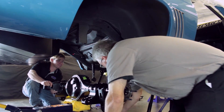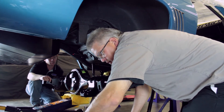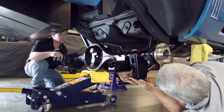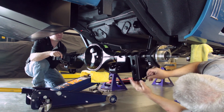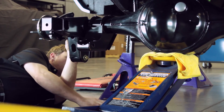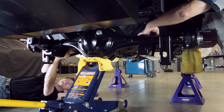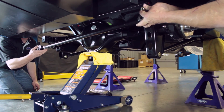With the test car, we have the DSC quad link installed, so we're going to attach the swivel links that are already mounted into the vehicle on the rear axle and put it in position. The lower link bolts will have to go in from the inside out with a nyloc nut on the outside of the bracket. Now that we've got the lower links attached to the rear axle, we'll go ahead and raise up the rear end so we can get the upper links in position. With the bushing end of the swivel link, we want to keep the flange to the outside of the vehicle. Now that we've got the upper and lower links connected to the rear end, we'll go ahead and install the track bar.